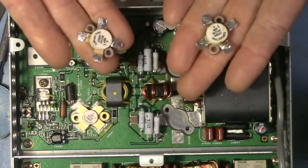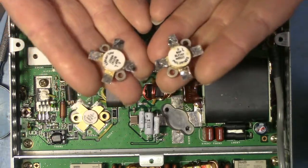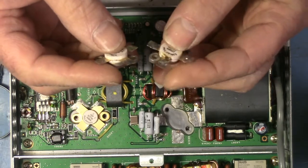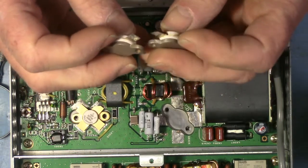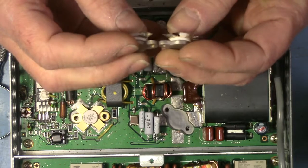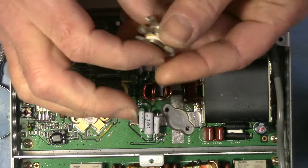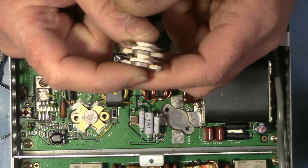And I just want to make a quick announcement for the sake of being overly cautious, perhaps. But these devices, and frequently external anode tubes, like the 4CX250B and the like, the ceramic that is used in these frequently contains beryllium oxide. Now, these are newer devices. They may have changed the formulation and they don't contain beryllium oxide. The Chinese shippers, manufacturers, suppliers, what have you, probably are under no obligation and have no inclination to send a little warning slip of paper in the box.